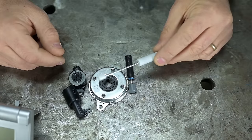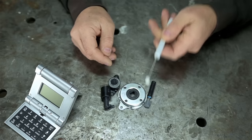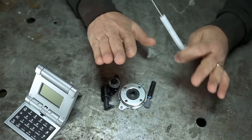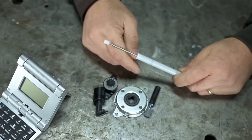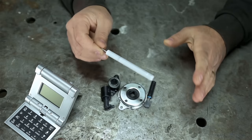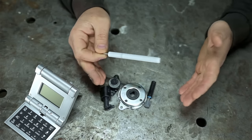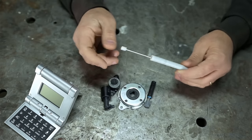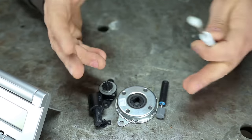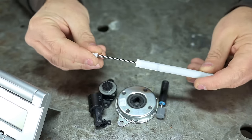The linear ones really live up to their name by moving in a line — they slow things down in a straight line. You probably have a bigger one of these on your storm or screen door. If you don't have a screen door, or yours happens to be the loud slamming type, think of this like a shock in your tiny little car. Your car has a suspension, right? There are springs in there. When you hit a bump or a hole, or drive up the curb fast while parallel parking in front of your friends, the springs absorb that blow. They'll do nothing for that humiliation you feel, but mechanically you inside the car don't feel it as hard as your tire or ego just did. The springs make for a more comfortable ride home to hide your shame. But if you only have springs and your shocks are shot, when you hit that bump your car will bounce up and down for an hour like in a Charlie Chaplin movie. So along with those springs you have — or should have — shock absorbers, linear dampers, which slow that bounce down fast.